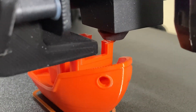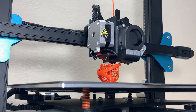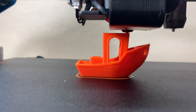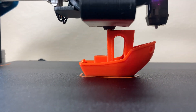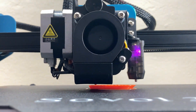Just below is a standard 0.4mm nozzle. The fact that the hotend is PTFE-lined means we cannot go to high temperatures — the maximum will be around 245 to 250 degrees. At these temperatures, PLA, ABS, TPU, wood, and likely PETG filament can be printed, which I think is quite enough. There's a fan duct at the bottom which closes around the nozzle.